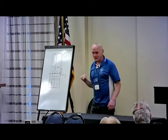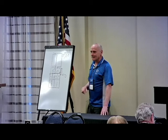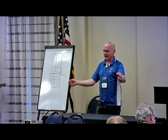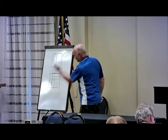The final one is steady draw. Now this is the tricky one. We really should see this be a steady stream of syrup, non-stop, the whole time we boil. It's theoretically possible, and actually, in some cases, people can do it. But if we can't do it exactly, we want to approximate steady draw. So in the old days of opening the valve wide open, don't do it. Because if you do, you start a tsunami flow this way. And then when you shut that valve, it stops instantly and we just mix the whole thing.